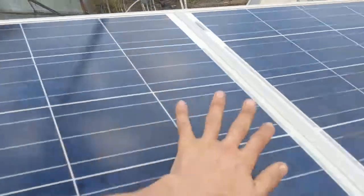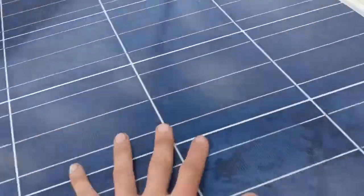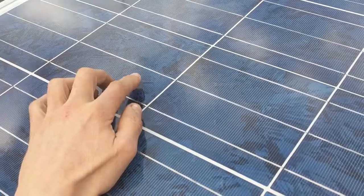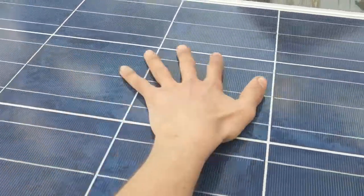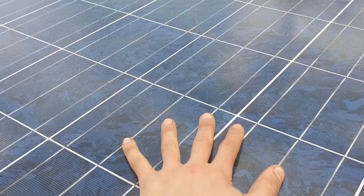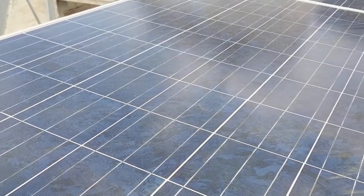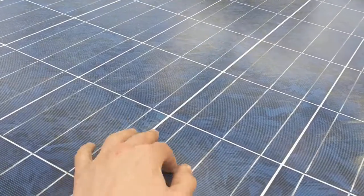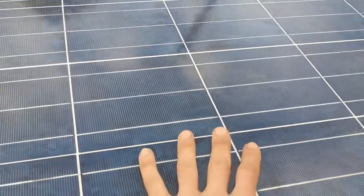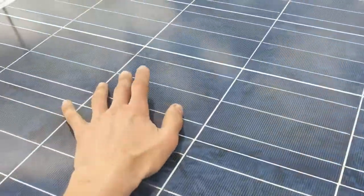It's a bit colder than this one - it's hot but not super hot. It's still a bit cloudy today. You can see hot water coming down at 30 degrees Celsius and going up at about 25. When solar cells go up to 50 degrees you have a power decrease of about 20%, because cells don't like hot temperatures. So cooling a solar panel could also lead to an overall efficiency increase of around 10%.